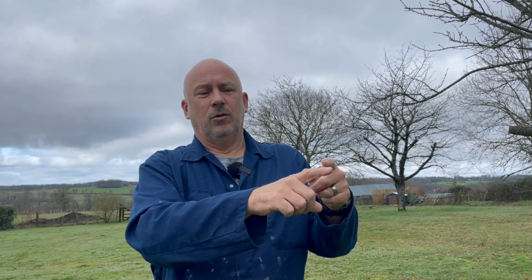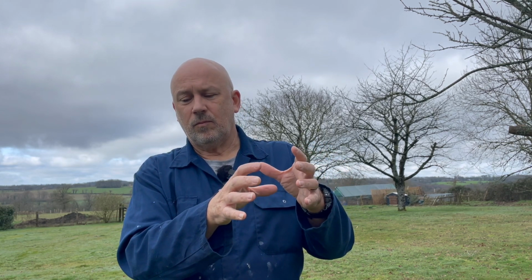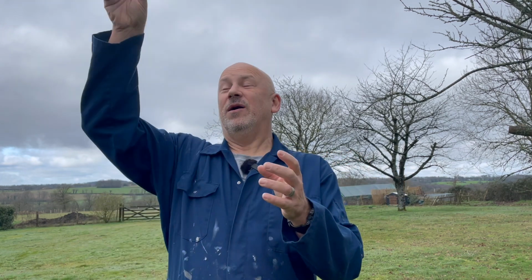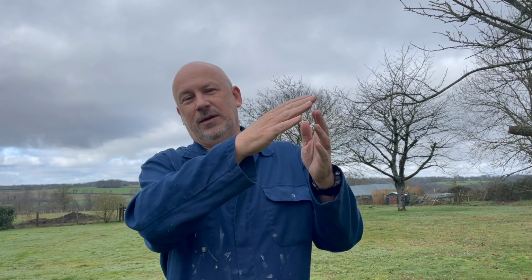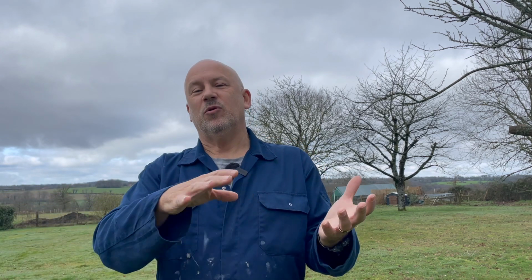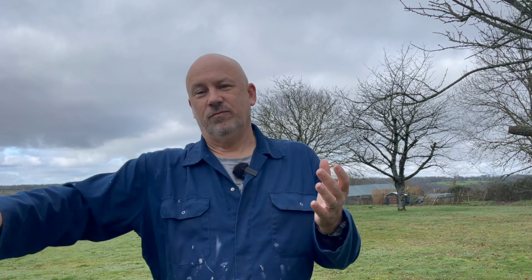Obviously, when the moisture laden air comes out of the bathroom and hits the cold pipe, the water in the air condenses, and that bit of the pipe was full of water. It was about that much water in it, so I took it off. I ended up wearing most of it, but that's fine. So I took it out from over the ridge beam and just did a nice gentle slope away from the fan, so any moisture that does condense will just run out eventually. Anyway, there's a picture of it afterwards.